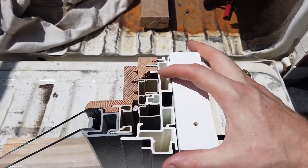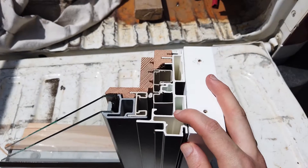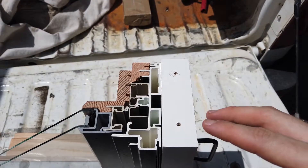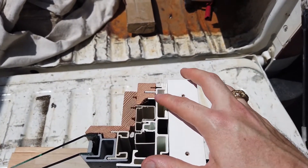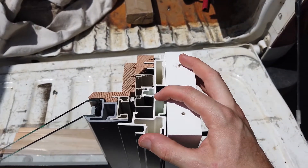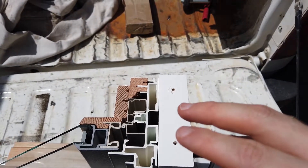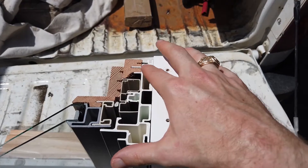One of the things that sets this fiberglass apart from your typical fiberglass entry door is this is what I refer to as pultruded fiberglass. When this material is made, they actually pull literally hundreds of individual fiberglass fibers first through a vat of epoxy, and then through a die that's in this shape. The epoxy-impregnated material goes through the die, which has a heating element, and the epoxy sets or hardens. What ends up happening is all these individual epoxy-impregnated fibers come through the die and emerge as a hard finished pultruded fiberglass product, which is what you see here.